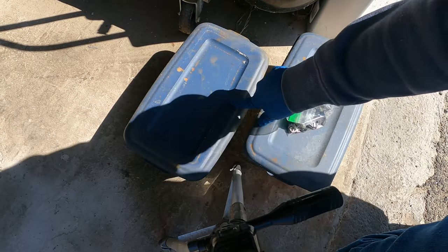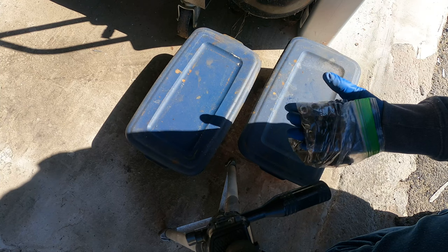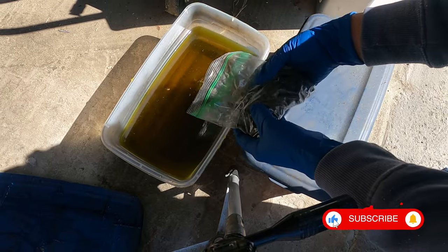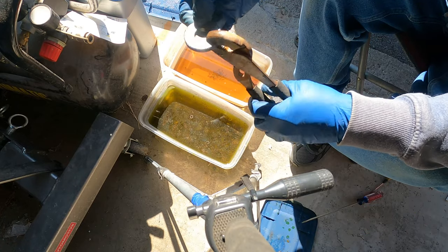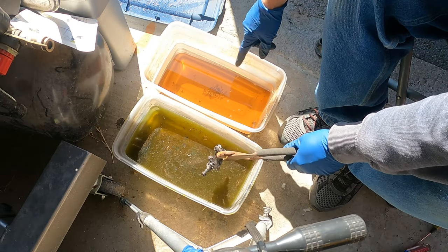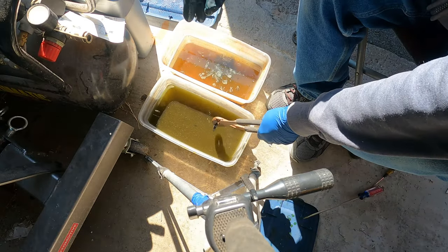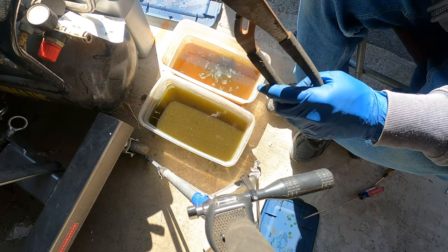Alright. We've got muriatic acid and water, and baking soda and water. We're going to strip and clean these bolts and get them rust-free. We're going to try one bag at a time. We're going to use this magnet to pull all the bolts out of the acid solution and put them in the neutralizer. That looks like all of them. It also looks like we might need to clear out our acid bath and refresh it.